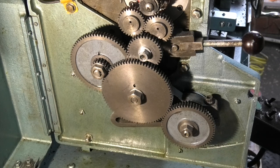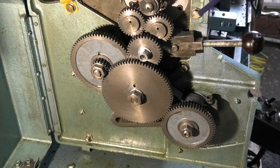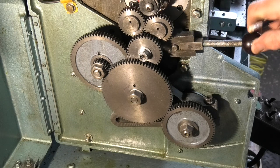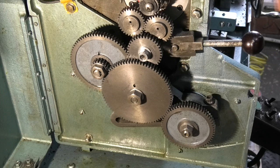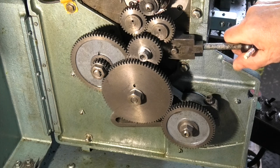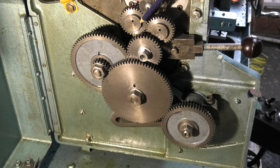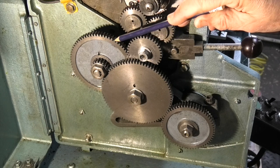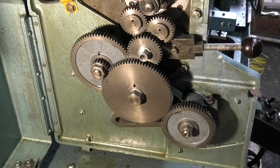This is the end of the headstock. On this one I've just put a rubber bung in there — that will stop swarf coming through your chuck, along the spindle inside, and dropping into your gearbox. This lever here is my forward and reverse on the lead screw. To drive from the headstock it goes from there into this one; there's a small gear at the back you can't see, so this gear turns the one at the back which turns this and drives these to give you the speed or feed you need on the lead screw.